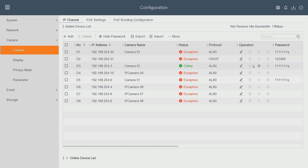In a scenario where you're swapping an NVR out, the probably best thing to do is before you disconnect everything is to go into this menu here, hit the Show Password option, and just take a picture with your cell phone. That way you'll have a list of the camera passwords and the addresses to the cameras as well, to make everything a lot more seamless when adding them to a different or newer unit.